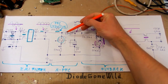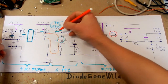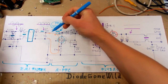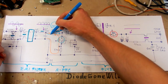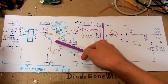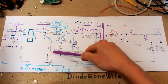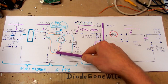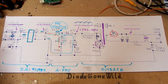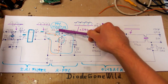There is also a diode which is a necessary part of the power factor correction. When the transistor is on, current goes through the inductor with voltage in one polarity. When the transistor turns off, the polarity changes and the voltage on the inductor adds to the capacitor's voltage, charging it. The MOSFET gate connects to the control circuitry. There is also a current sensing resistor - low resistance, just 50 milliohms (0.05 ohms) - from which the control circuitry senses the current through the transistor. The inductor also has an auxiliary winding, probably to power the control circuitry.